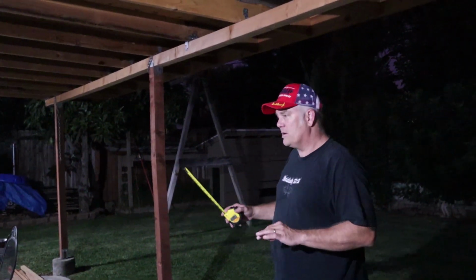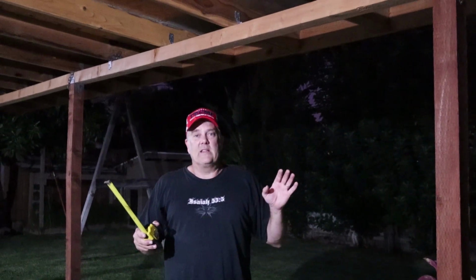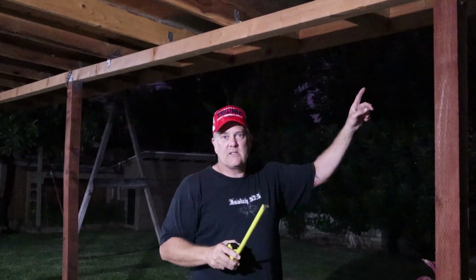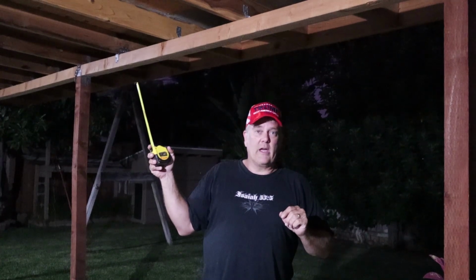you want to have as little waste of wood as possible, right? So lumber comes in 8 foot, 10 foot, 12 foot, some 14, 16s, and then occasionally 20 foot sections, right? So I wanted to make as much use of the wood as possible, as well as what I was going to be topping it with. I used 10 foot 2x6s. 2x6 was strong enough, and I put them on 24-inch centers, okay?